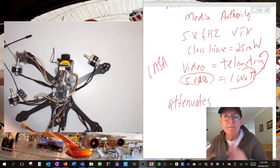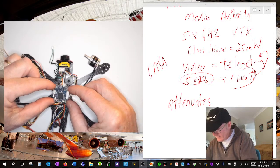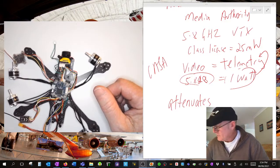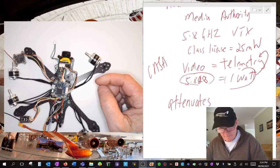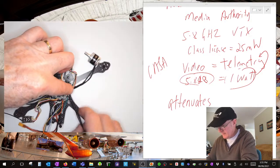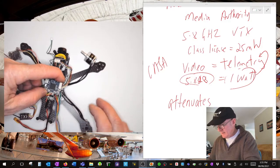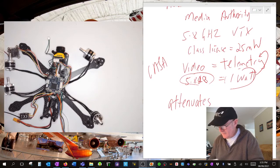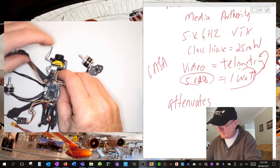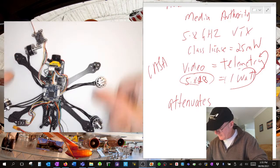You don't want to put your fingers all over the board either, okay? The grease on your fingertips will eat into the etching on the board, so handle them around the outside, handle them by the plastic parts. Don't be touching chips on a cold, dry winter's day. Short yourself like in your bathroom on the tap there, because that will go out through the metal to the ground, through the copper. Brass, whatever that's made out of. But don't be pulling your jumper off on a dry day and then touching the electronics, because your static will discharge into the device, into the chip, and it'll do just a little bit of damage. Maybe not even enough to stuff it, but just a little bit. Then it happens again, a little bit, and you'll start having these intermittent problems. Just checking that the holes are in the bottom before I do anything more.